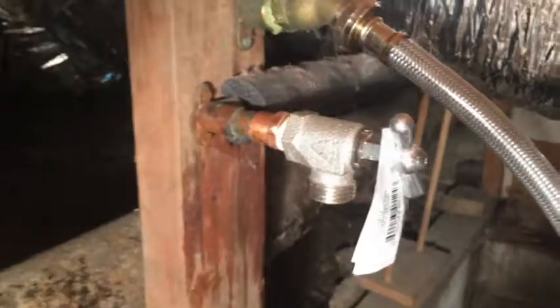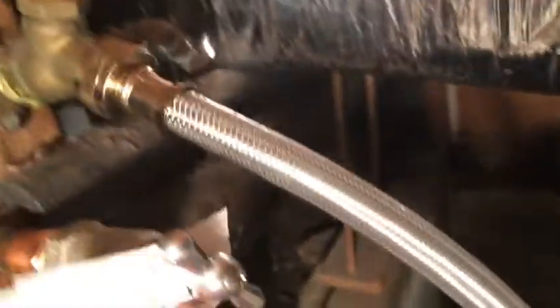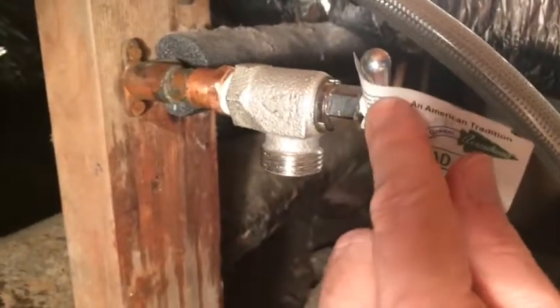So if it's a hot water line, it's good to go to the water heater. If you can see that this valve is in line — that's open. What you do is turn it so it's perpendicular and that would shut the water off to the water heater. But we did it — it wasn't necessary. If you're sweating pipe, you'd have to do that. Otherwise it just tends to drip a bit longer. Just check — use your finger to look for any moisture. The valve will be fine. The other one was leaking at the stem — that's why it was replaced.